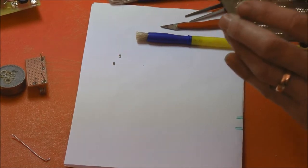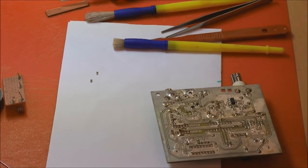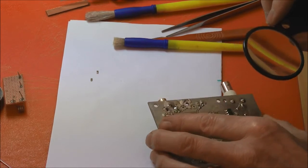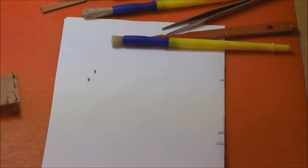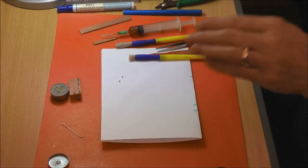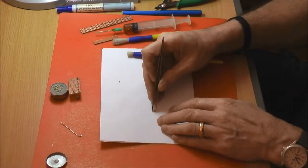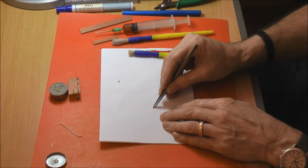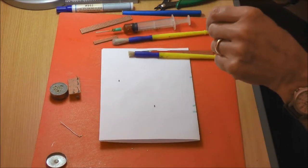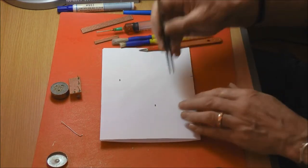If you want to pass that round. Quick look at me that way, so it doesn't look too much of a mess. So that should be stuck in there. With the chip capacitors, there's a technique where you can literally melt the solder, use tweezers or whatever, and slide the component from one end onto the melted solder. Or similarly, you can pin it down with a cocktail stick and tack one end and then solder the other. Can you just have a look at one of those in my hand?